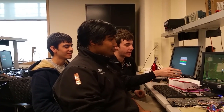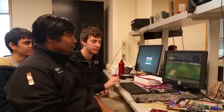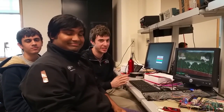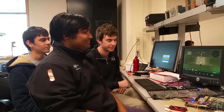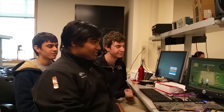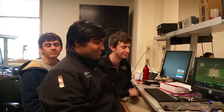We currently are outputting this with just 8-bit color. We actually added support on the PCB for external SRAM, so we could store it all in 24-bit color. Unfortunately, in the interest of time, we haven't implemented that, but it's there. Color's good enough. And that seems like something you might end up reusing for another project. Especially the ADCs on board, they go up to a max of 100 MSPS. So you're thinking digital oscilloscope. Yeah, front end. A three-channel digital oscilloscope, full bandwidth.